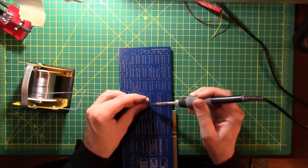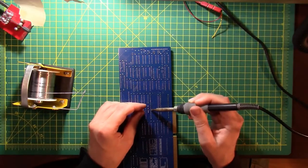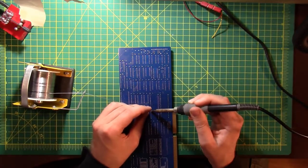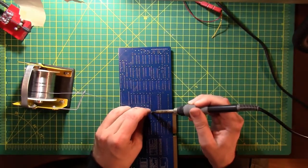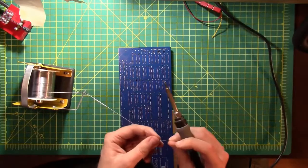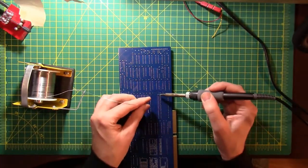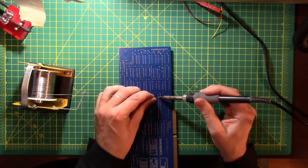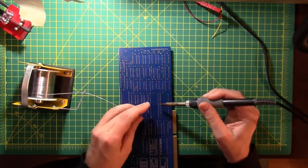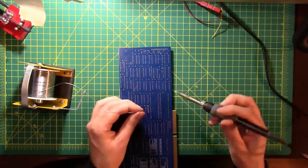So I'm kind of debating whether I want to put it in or not. And I'm also debating, I think I've already got the clocks set up for 10 megahertz, but I'm debating whether I'm going to get a V20 or V30. I think the V30 is still compatible, I'm not 100% sure. The NEC V20 was a pin-compatible, instruction-compatible variant of the 8088 processor in the day, but clock cycle for clock cycle, it was actually faster than the Intel chip. And I had an Intel 8088, so I doubt I'll notice any difference. No matter what I run on these machines, it's going to be slow just by its nature, but I might do it just for fun, as much fun as swapping one CPU chip for another CPU chip that's slightly faster can be. I mean, hold on to the edge of your seats, guys.